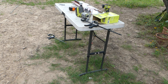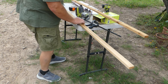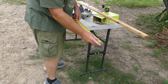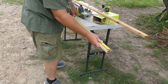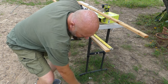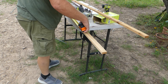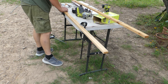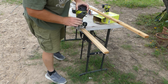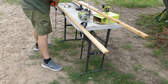All right, let's knock a little weight off of these. I might even cut them on the edge. I found a couple that don't have a lot of knot holes on the edge, so I think I can route them without much of a problem. The bottom window sill is 19, so I'm going to clamp it there so that I can put a little bevel on it. I'll clamp it at 20. And then the other side is 72, so hoping that I'll have enough room. So one side of the window should be made with one of these. If I route two of them, I'll be okay. I'll hit that clamp, so I'll have to stop and go around it. I'll do something over here when I get to it, undo the clamp or something.